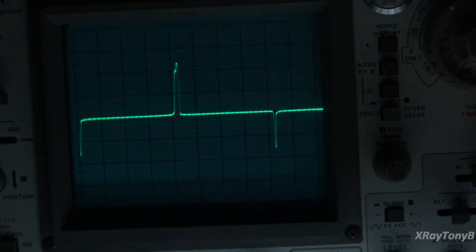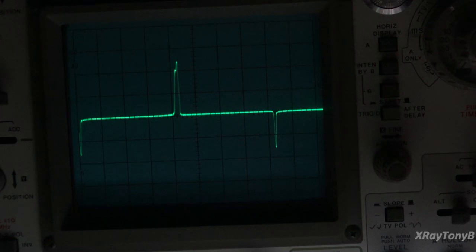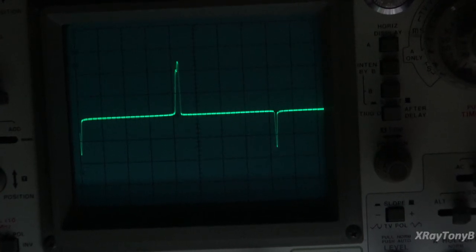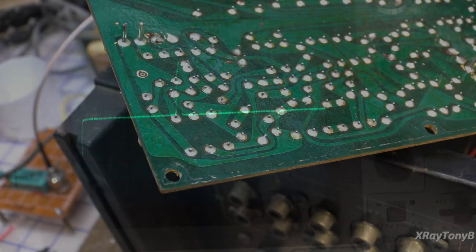In this test jig you can put a PNP or an NPN transistor — it will compare either one. With NPNs you'd just see the VBE on the opposite side, because one transistor works off the negative portion of the sine wave and the other off the positive portion. Hope that doesn't confuse you, but that's my explanation of how this thing works.